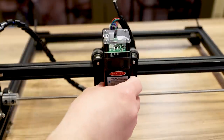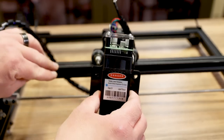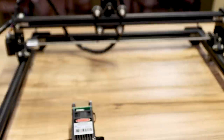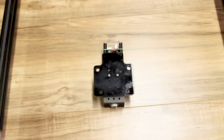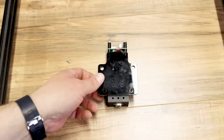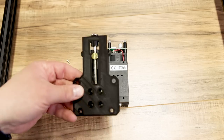Once you have those caps off, pull the laser straight off and push the gantry backwards — we're gonna work right in the center of the laser. Now that the laser diode is off, flip it over and take out the two screws that hold it to the mounting plate. Once that's off, set the old plate aside and bring in the new plate.